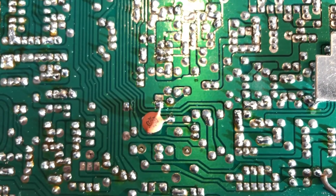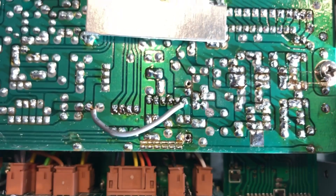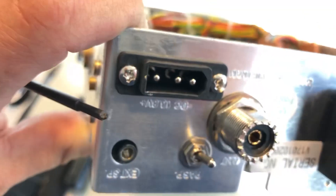Tone control — just like that. There's the clarifier. And if you want to do a 10K mod, you can mount a switch in the hole in the back where a PA speaker would be. It just has a plastic sticker over it.